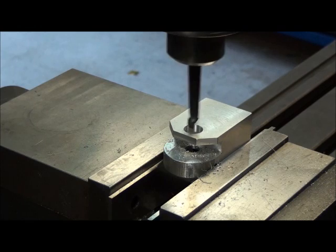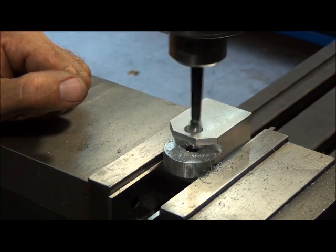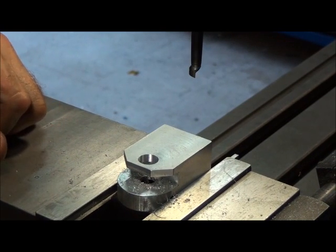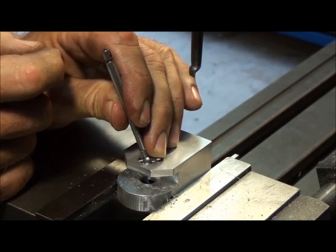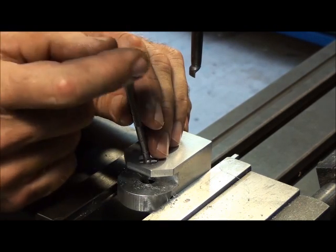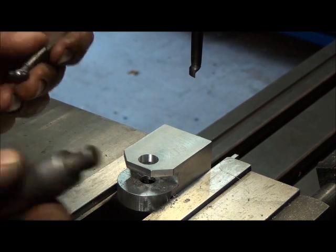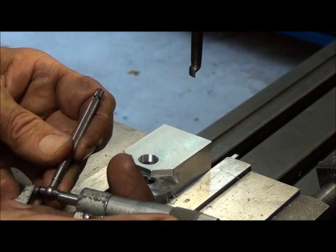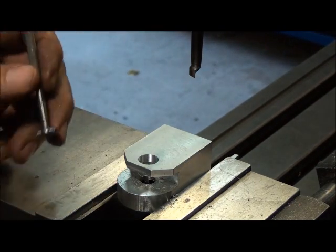I like to make a few spring passes through without resetting the boring head, just to make sure you get all the spring out of the boring bar. I usually take four passes — two in and two back out. Let's move it aside and see what we have. I'm going to go with the telescoping gauge again. This hole is a little shallow so it's harder than it would be with a deeper hole. A little bit off axis, snug up the gauge, and rock it through center just once. You transfer the diameter of the hole to your gauge, then go ahead and measure it. We're shooting for 498 to 499 — we've got 499.3. That's good. I backed off a little bit, which was a good thing or I would have gone over.